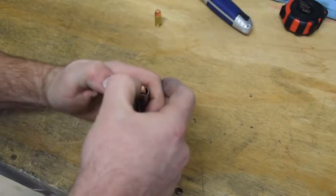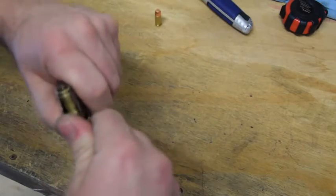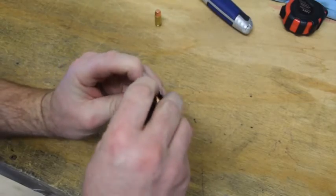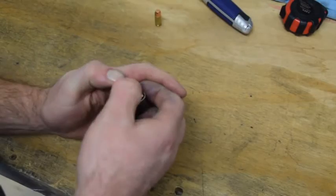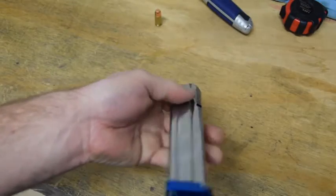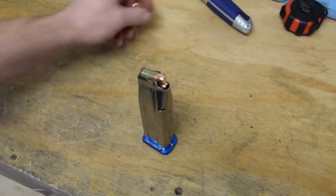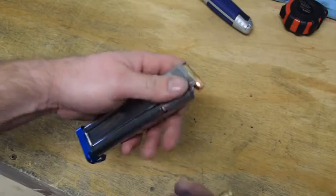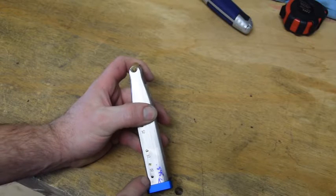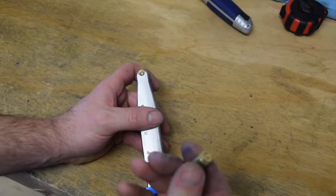Still got a gap there, so I push on it and that gap gets better. I'm going to go all the way to 20. Keep pushing that down — it's looking better. Now if I unload this it should have set that spring and we should be good; it should be that simple. But we're all greedy — there's 21. If you drill this hole at .545, you'll get the rim of the case at 20, and hopefully with some luck you'll get the primer at 21.